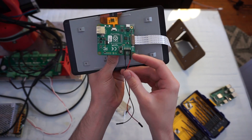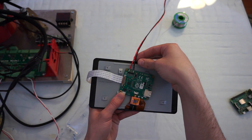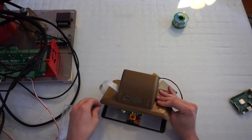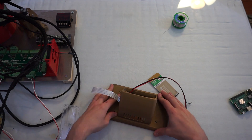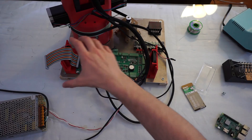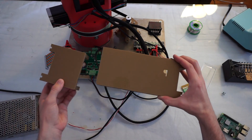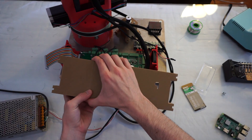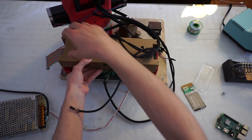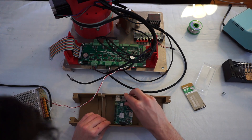The touchscreen monitor needs 5 volts for power. While reasonably priced, the slush engine board is still pretty expensive, so it's very important that we protect it. We 3D printed a housing so that the robot wouldn't hit it and it would stay protected. Unfortunately, the housing was too long to be printed in one go, so I printed it in two separate pieces, which I'll join with dowels.